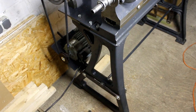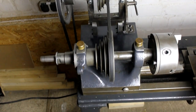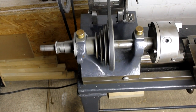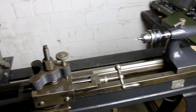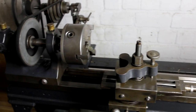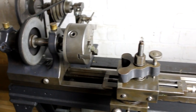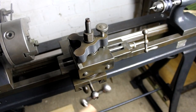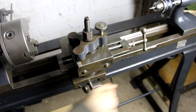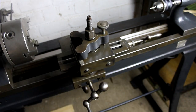If there's an English name for that part, let me know. So I put it all back together, except for one part: a bar that transfers some of the motor's weight onto the fork-shaped piece that puts tension on the belt between the two variable-diameter pulleys. I tried to put a lot of pressure on it manually and then fixated that with a bolt, so I think it's good enough for a couple of tests.